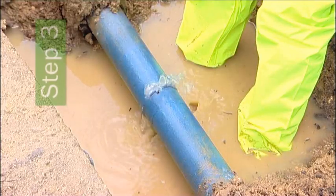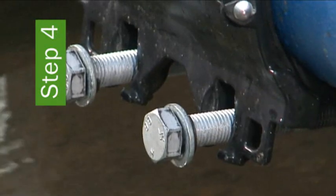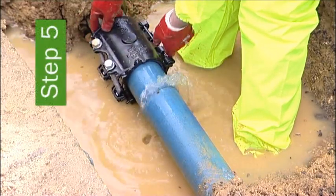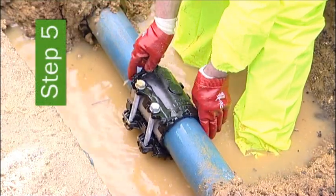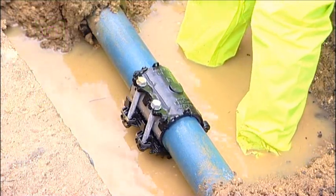When installing a Remote Repair Clamp manually on a damaged pipe, we recommend it is initially positioned adjacent to the damaged area. Let the two hinged halves drop around the pipe until the bolts click into place over the lugs. Once the bolts are hooked in place, the clamp should be rotated to permit direct access for tightening of the bolts. It can then be slid over the damaged area to effect repair.